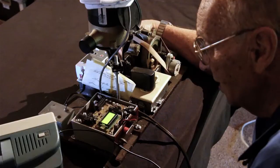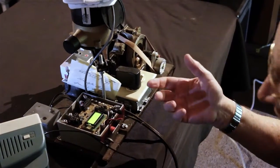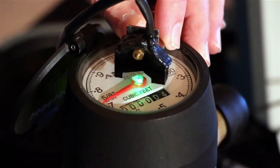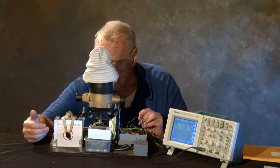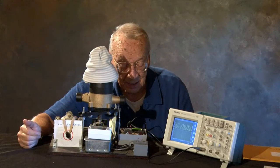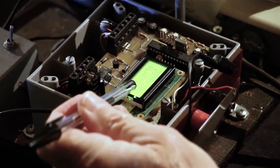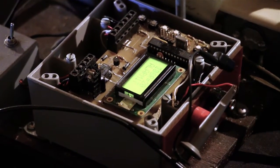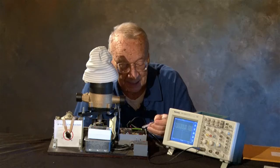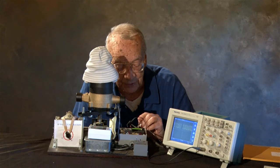There we go. We generate an alarm by increasing the rotation of this shaft here, which is the equivalent of more water flowing through the meter. We went into the ready state — I've generated again a greater flow than we want, and it will go into alarm here very shortly. There we go — it indicates alarm. It will stay in alarm as long as that flow rate continues, and also indicate how many gallons are flowing. There's that little pause after about 22 seconds, and it indicates the flow rate.